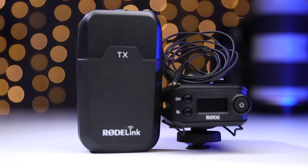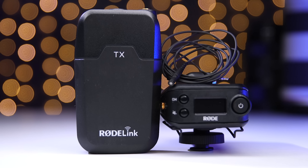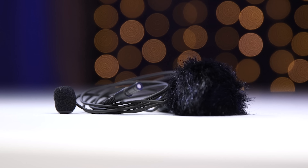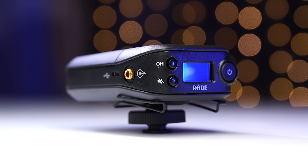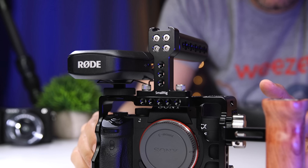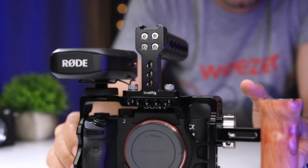If I have a subject that's moving around or I just can't get close enough to get good audio with a shotgun mic, I usually go with the Rode Link Filmmaker Kit. It's a great wireless kit that consists of three components: the transmitter, which we clip onto the subject; the included lavalier mic that connects to the transmitter and is clipped somewhere on the subject's clothing close to their mouth; and a receiver unit that we mount where we originally had the VideoMic Pro Plus, connected right to the camera. What's great about this setup is that even if the subject is moving, turning their head, or turning their body, the microphone is essentially moving with them and I'm getting consistent, clean, and crisp audio.